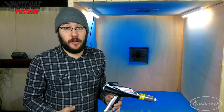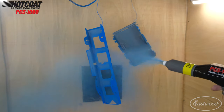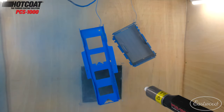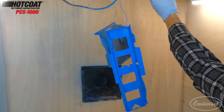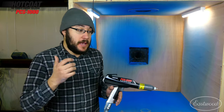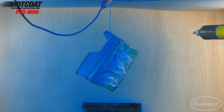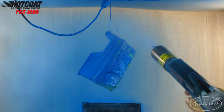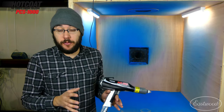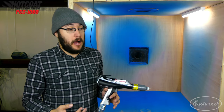The ability to put out the powder is also incredible. Just using the standard all-purpose nozzle, I can get fantastic coverage on my parts — I don't worry about missing spots. I'm not dealing so much with that Faraday cage effect where you have to put a deflector on to work the powder in. You just crank the voltage up, hit the spot you need, and it just sticks instantly. The powder clings a lot better — I had a harder time removing uncured powder from parts done with this unit compared to the previous one. That extra voltage just gives you such better cling, and this has been huge for me.